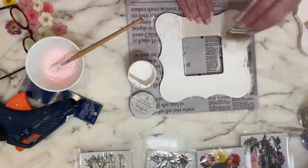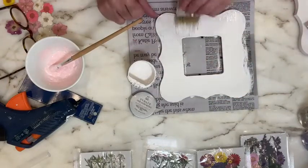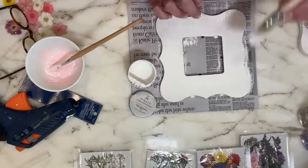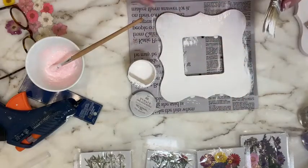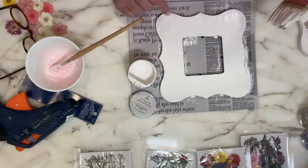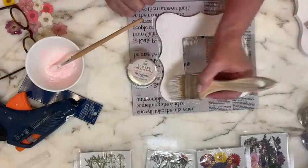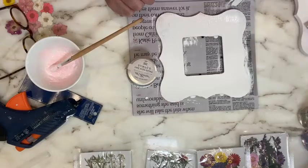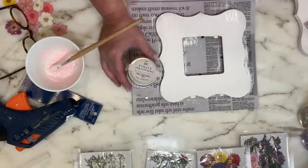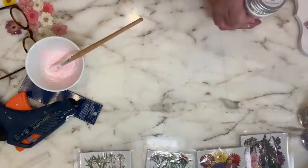This is our number one selling color, it's called Bauhaus Buff. It's a very thick, chalk-based paint but very durable. I moisten my brush in water before dipping it into the One Step because I'm working with raw wood, which absorbs more. A wet brush minimizes brush strokes. I'd really recommend allowing this to dry and then putting on a second coat. Also, paint with the grain — don't go cross-directional, or you'll get what's called cross-hatching. I painted a frame just before going live so you could see it done.